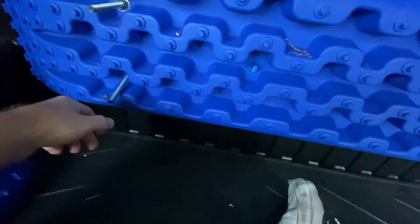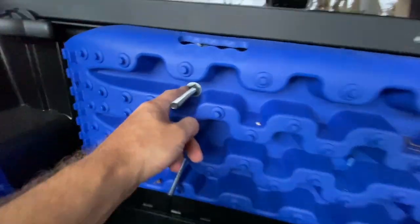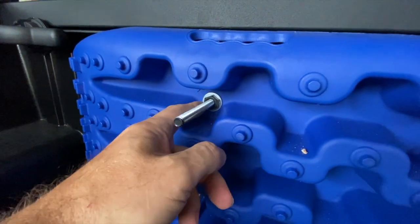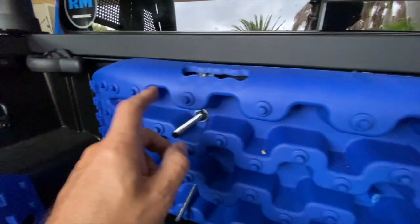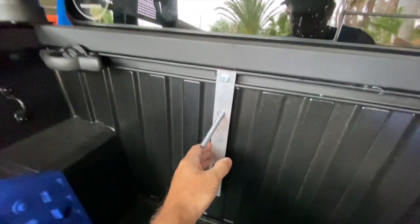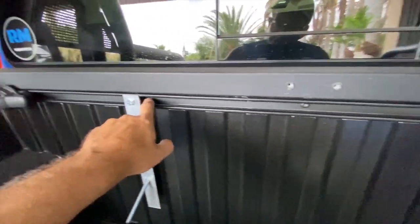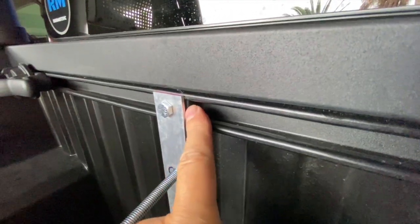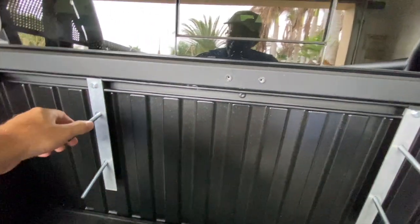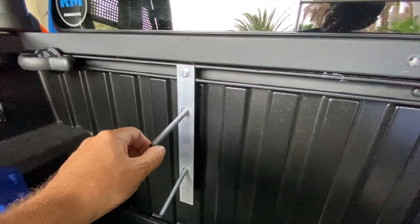You can see here's the screws through. Fortunately, there's no bees nest or anything in there — didn't even think about that. I do have some other nuts in here to contend with. I did that to secure these so they didn't bounce around. I'm going to have to pull those nuts off to be able to remove everything, because we are going to change these studs out to something longer. The boards are off. These are the little strips I put in, just bolted in the tracks here by these little blocks that are threaded. I'm going to mark where these are so I don't have to measure again, because I have to pull these off to put bigger, longer bolts behind them.